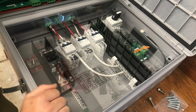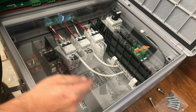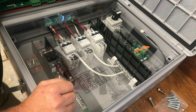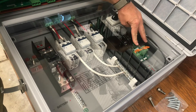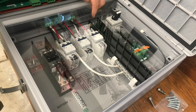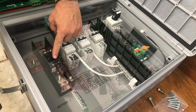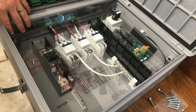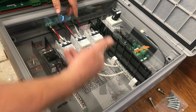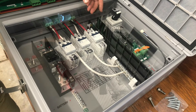You can see they've got everything in here with plenty of room, and we don't have a bunch of combiner bars in here like we used to have — everything is direct feed breakers. Starting from the right to left, we have the 600-volt DC disconnect with the dual-string MPPT inputs, the critical load output, the generator input, the grid input, and then your battery 175-amp breaker. It does come with all the jumpers to connect all the battery portion of it, and basically you just feed your inputs into the system and you're good to go. This is going to be a much speedier install than even the pre-wired GSLC with the way that they have it.